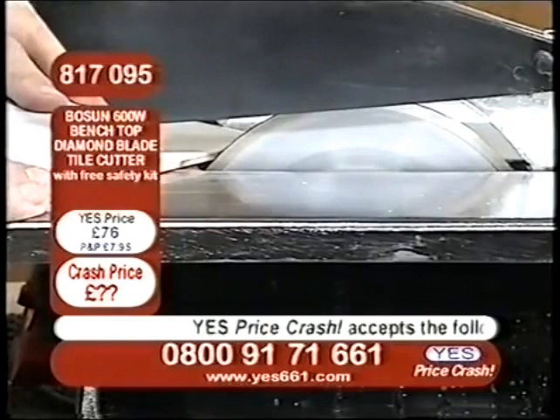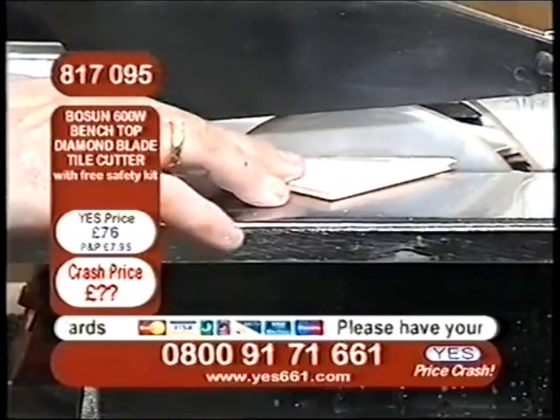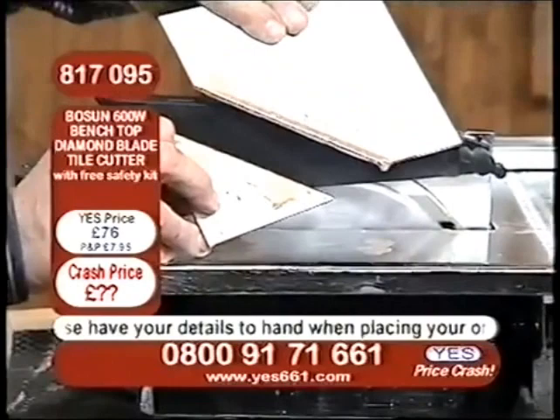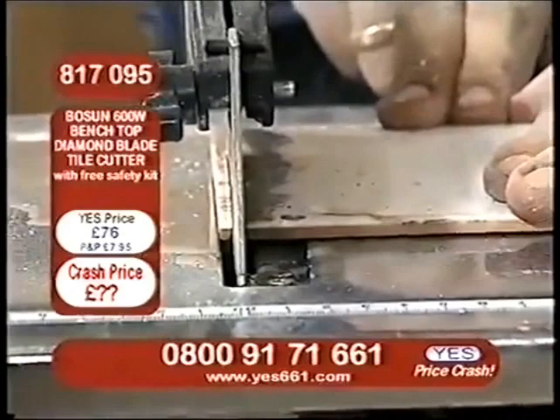Remember, when you traditionally think about a tile cutter, you'd think that it would rip and splinter a tile. But because we've got that diamond-coated blade, it's actually grinding it away so quickly, it's leaving an absolutely smooth edge. So you can literally measure to the nearest millimetre, simply wipe away the excess moisture — the dust is contained within — and then just get on with the tiling job. How many tiles become casualties along the way when you try to score a tile and it snaps into 22 rather than 2? It's so frustrating. Something like this would make the job so easy.